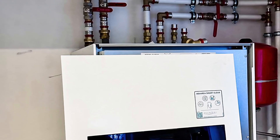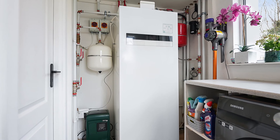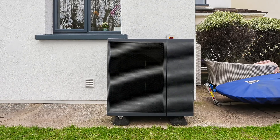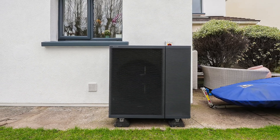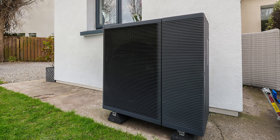Graham's property has a nine kilowatt all-in-one L-Series R290. The big change with the R290 and the L-Series is the anthracite grey outdoor unit. The water connections and hydraulic connections are between the indoor and outdoor units, so unlike previous models the gas is now all sealed safely in the outdoor unit.